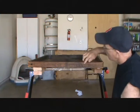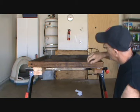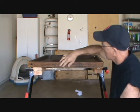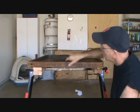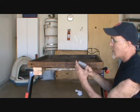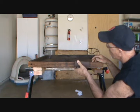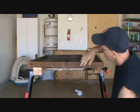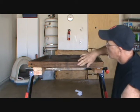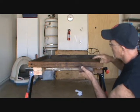Now my table has 4 rounded edges on the side, and it's a solid piece of wood, but in order to keep the integrity of this really pretty rounded border, I've decided to use a block of sanding sponge that will mold to the corners so that I don't change the actual dynamics of the rounded edge. So it shouldn't take too much, because again, this wood is very dry and it should sand out pretty easily.